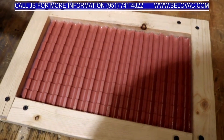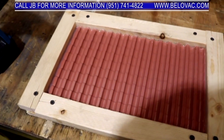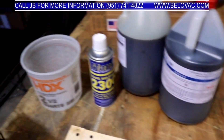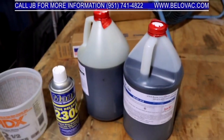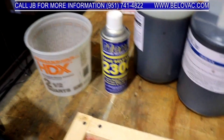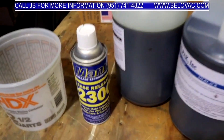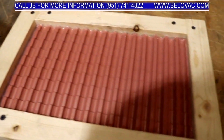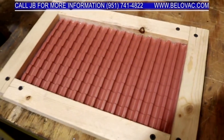We have our existing plastic part mocked up. We made a reservoir around it so we can pour our urethane into it. It's a two-part urethane with some filler mixed into a small bucket. We're going to spray some release onto the mold, pour it, let it cure, and then we'll have a usable mold that we can vacuum form with.